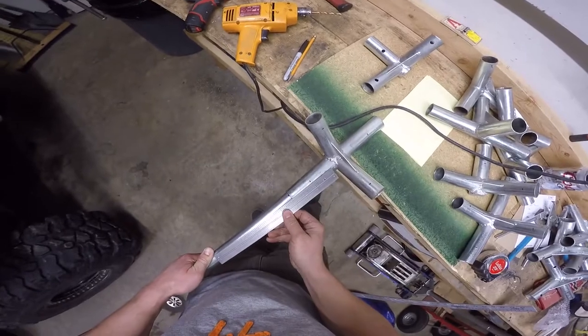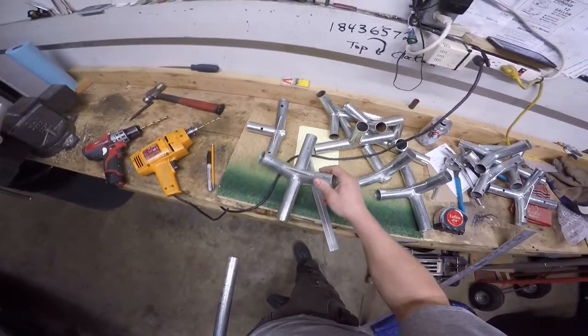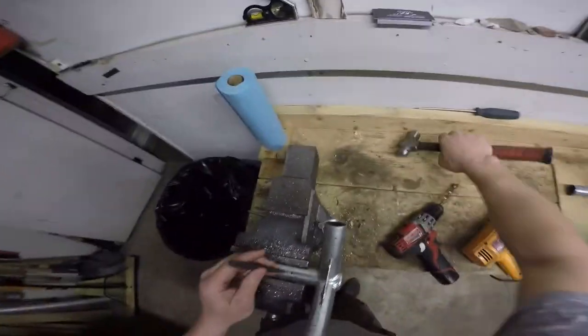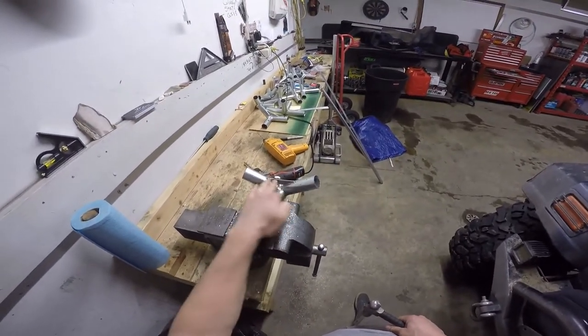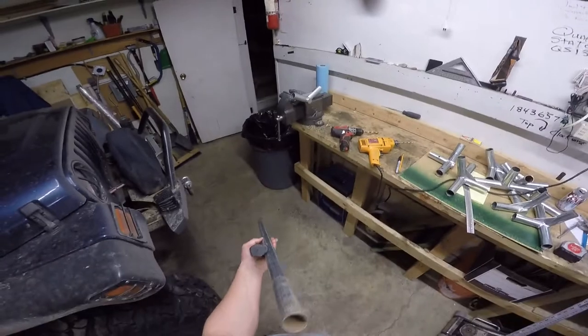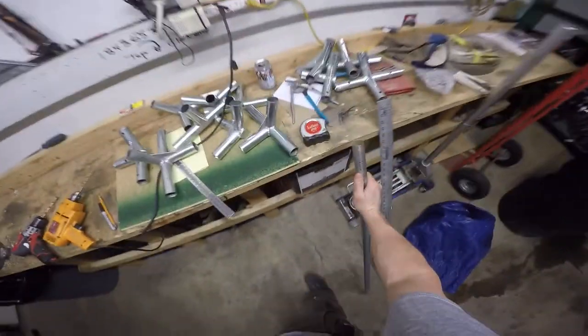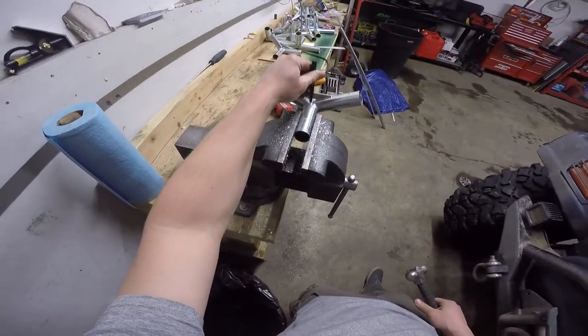Some of them are a lot deeper — as you can see this one, I had to mark down two inches from it to find the three. So I've got them all marked three inches from the bottom. Now I'm putting them in the vise one at a time and taking my punch, trying to go right dead in the center. You have to remember that if I put a button on this side of the pole and a button on this side of the pole, I'm going to have to make sure they're exactly lined up — otherwise I might hit the hole on one angle iron and be off to the side on the other.